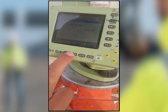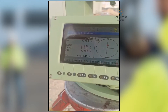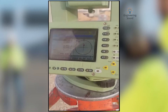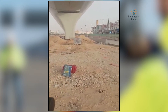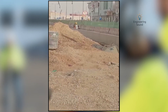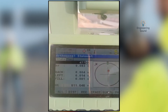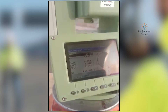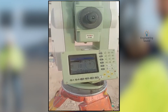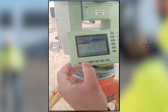Click now and you will see the situation. Target the prism very well from your total station, point to your helper to come in front of the total station. Once it is observed well, press Enter and All to observe. Now check how much the difference is in easting and northing — you can see. You must click on Distance; the F2 button is the Distance button.